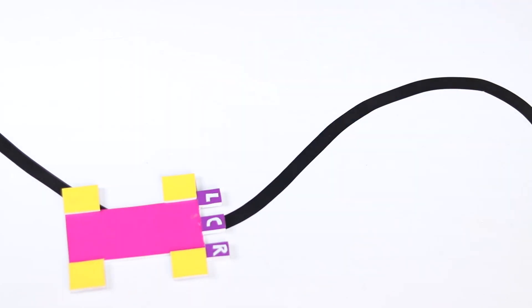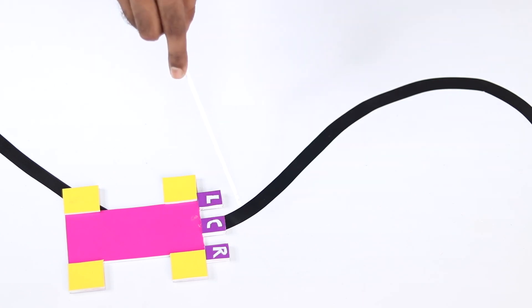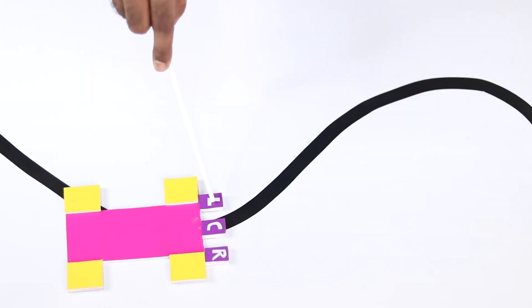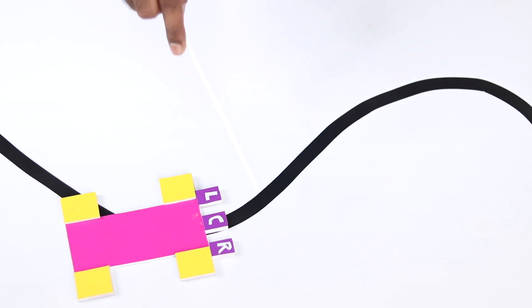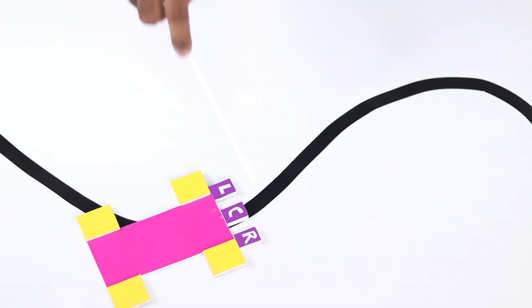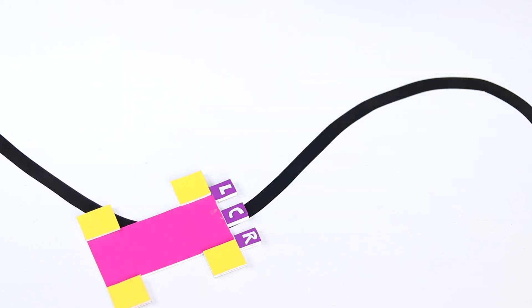How are we going to do that? It's simple. The center sensor will always check for the black color line, and it will say yes if a black color line is being detected. On the other hand, the left sensor and the right sensor will always check for the white color patch. Whenever a black color patch comes for the center sensor, it will say yes. And whenever a white color patch comes for our left and right sensors, they will say yes. When the center sensor says yes and the left sensor and right sensor also say yes, this is the most ideal condition. For this, the four wheels of the robot become activated and the robot moves forward.